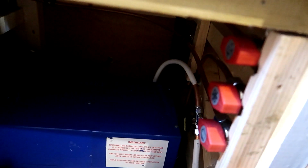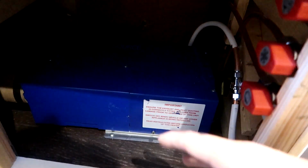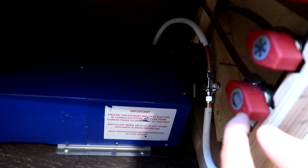This is a massive upgrade for us. If you've seen our videos before, we had some issues with our heater, and because of that, it messed up the entire system. Now, if there's any problem with just one part of your system, you can shut it off and still use the other parts. Gas comes into this, goes to our heater here, this goes to our hob/oven, and then this goes through to our water heater. And you can see it's all fastened down with clips and runs off.